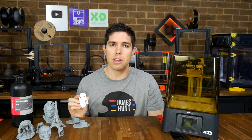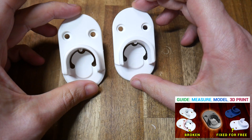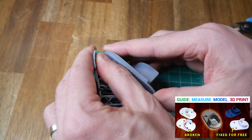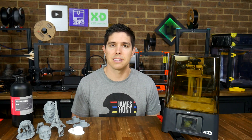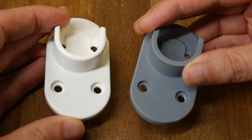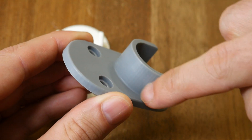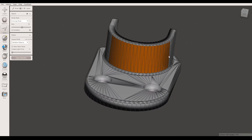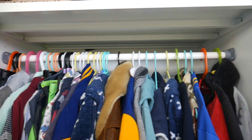You might have seen my video on this IKEA wardrobe clip — one of them was broken, and I used 3D printing to reproduce a hard-to-find part. I made one from resin using this printer, and again, the quality is excellent. The surface finish is almost as good as the original injection-moulded part. In fact, the only thing letting it down is that it's so detailed you can see the individual polygons that make up the STL. This type of part is probably unusual for a resin printer, but this test shows it is viable if that's the only option you have.